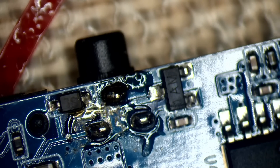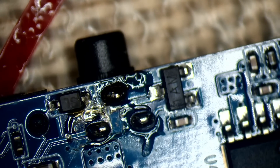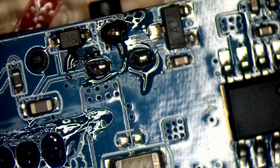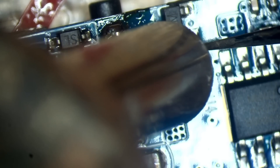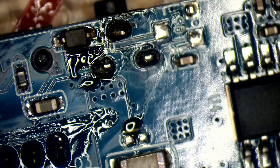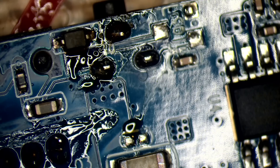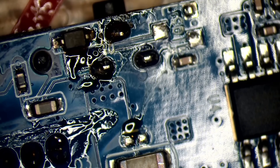Let's remove the transistor and see if that removes the short. I think it's probably going to be the transistor, but I'm not going to remove it at 169 degrees Celsius. Let me just try and remove this button — well, the plastic from the button. Trying to get some very focused heat there. Yeah, transistor's blown. It was short to ground. Let me find a donor board to nick a transistor off — maybe something around a five volt circuit or a USB circuit. I think I'm going to need possibly a PS5 board.